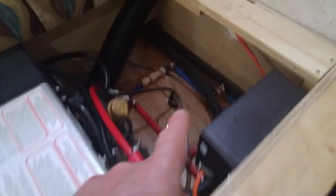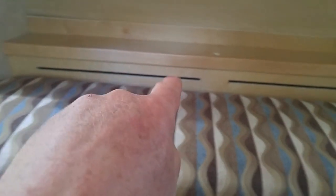Think about it — here come the pipes, they go up and across in that radiator and come down. If I open this drain, what happens to the liquid in this pipe? Nothing — it stays there. This is a low spot, this is a low spot, but that's not. So just opening that drain will drain a little bit, but you'll still have this whole radiator full, because this radiator is lower than that one.